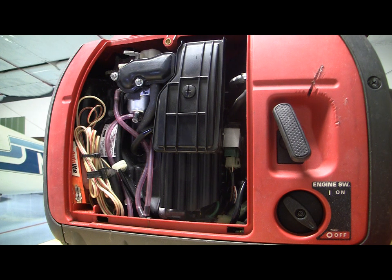This is an air-cooled engine at 20 below. The air circulating around here can freeze this breather. If this breather freezes and gets plugged up, the engine will quit. So how do we mitigate that? Well, the best way to mitigate it is go to Bailey's Tool Rentals. They have a winter kit that's made for these Honda generators. The winter kit's $98, and they'll install it for 1 hour of labor, and that's $100. For $200, you can solve this problem.